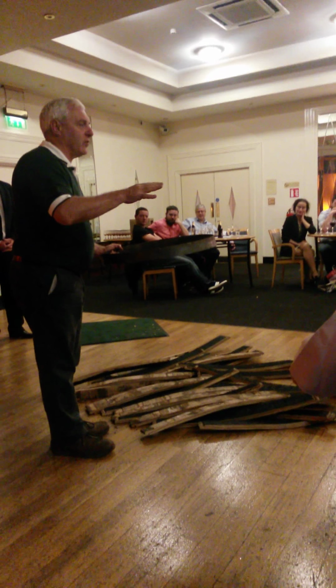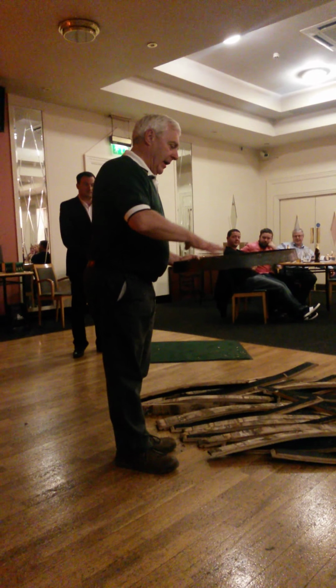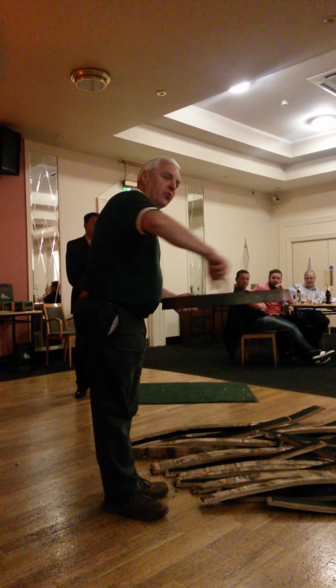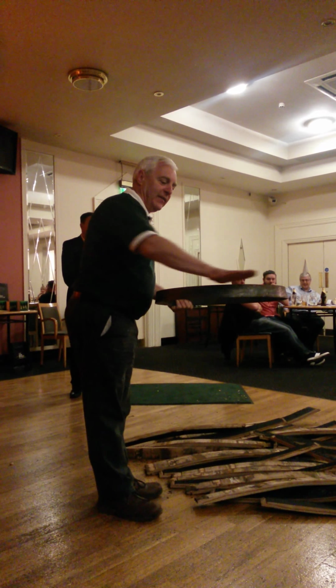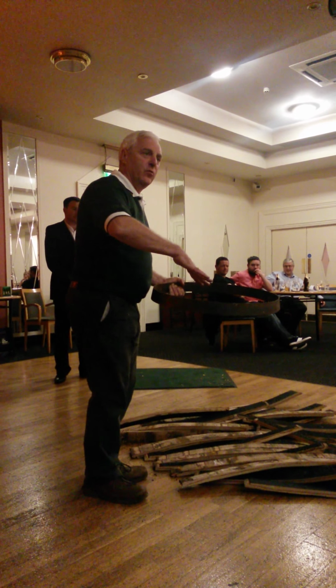Only here and in some parts of France where they're made. Other than that, it's steel dividers. And you have a different size compass for every size cask. And then when you go around 6 times, that gives you your circumference. Other than that, I have no other measuring tool. So once I fill this with enough wood that it's level, that's the size of my barrel. I know the height, that gives me my size.